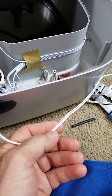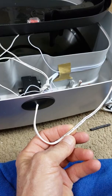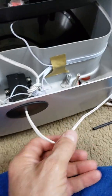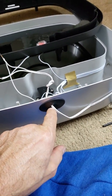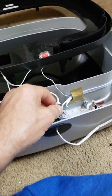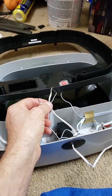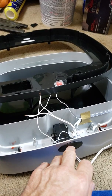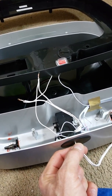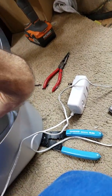On this adapter I wasn't sure exactly which side was power just by looking at it. However, the positive is supposed to be the broken line — broken line is positive on these transformers usually. When you come through, drill a one-eighth inch hole or just a little bit smaller, tie a knot in that cord because it's going to act as a strain relief. When I'm done soldering and shrink-sealing these connections, I'll tape them down and use a hot glue gun to glue both sides of this wire as additional strain relief.